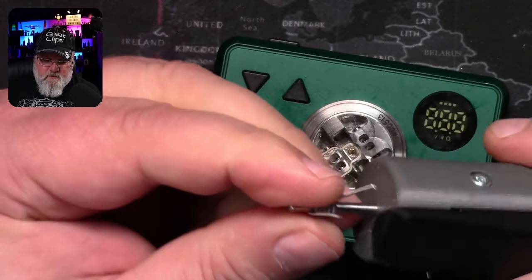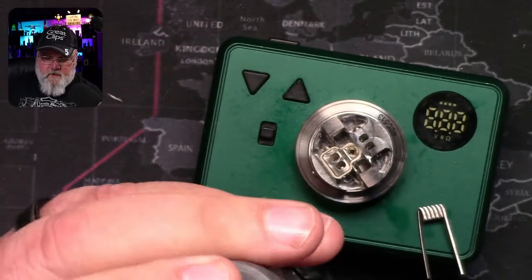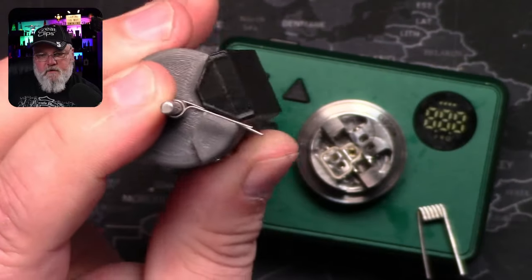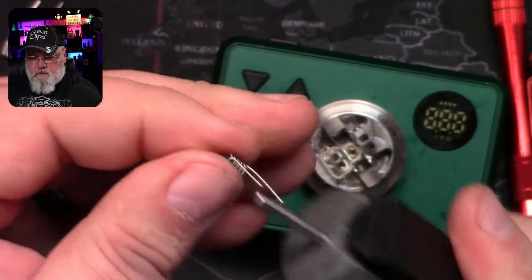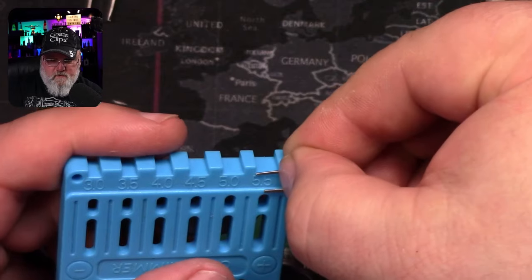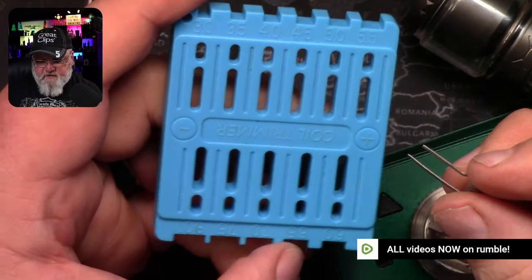Not down the middle like I normally do it. So that means we drop our coils in here, secure them, and we're going to wrap this until you get a 90-degree angle. Then we're going to use our non-marring pliers and bend that back 90 degrees — we'll do these for both coils. How about the height? That's the depth of our well — five and a half millimeters of depth. Then we're going to want to come up another millimeter or two. Six and a half — we'll go with six and a half millimeters.